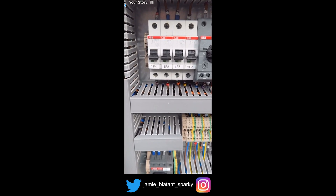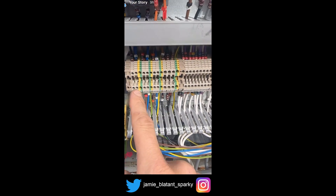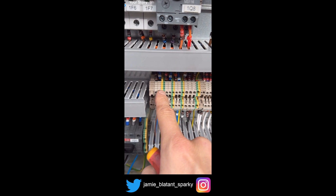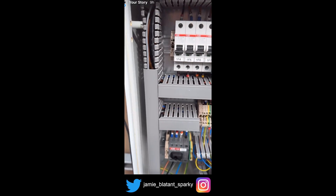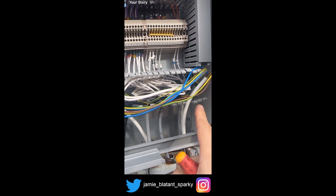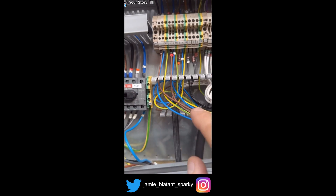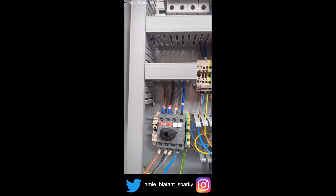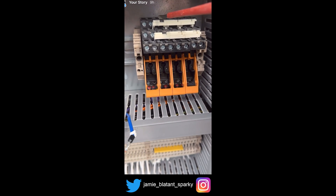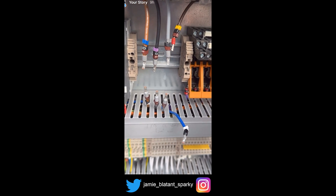Let's get an overall view of it. There are no drawings, so I numbered the auxiliary supplies: 101, 102, 103, 104. That one goes out on a flex I identified going to a level instrument on one of the tanks. This one goes to a level instrument on another tank. There's a third I identified going to a heater. Which left me with — there's no 104 here — because 104 comes out of there and ends up going into the common rail on these relays. And 105 comes out of here and goes to the contactor on a common rail.